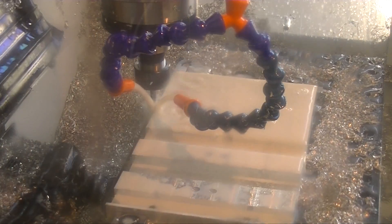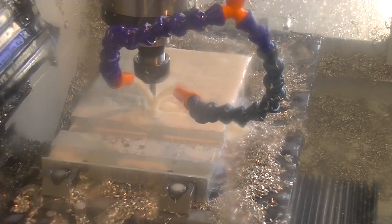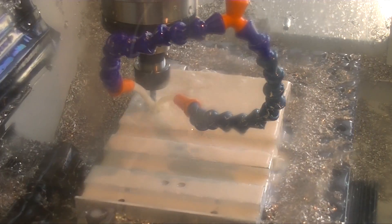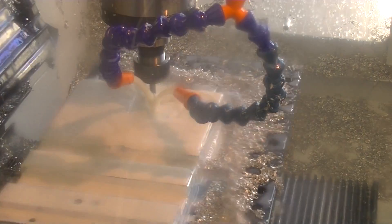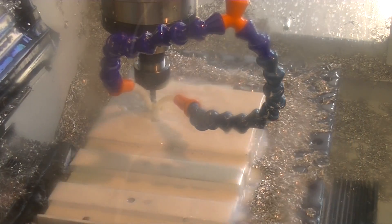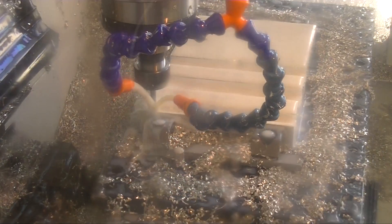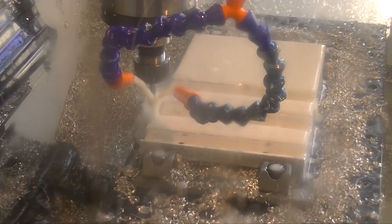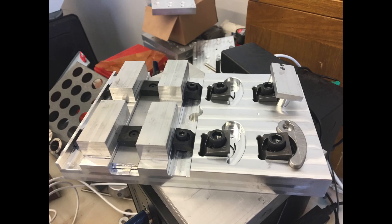All right, deburring — quarter inch, 90 degree, two flute, Lakeshore Carbide, 10,000 RPM, 50 inches a minute. I was doing a 20-thou chamfer on this. Even at 50 inches a minute, it's beautiful — I could probably run it closer to 100 inches a minute if I wanted to. Going back to some of those mistakes I made, I missed a couple of the holes to get chamfered. I went back and did that afterwards, but because my heights weren't right when I did that, I got messed up chamfers. But this is the final view — thanks for watching.